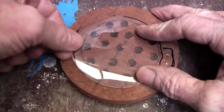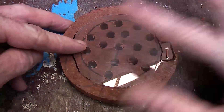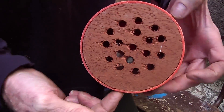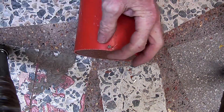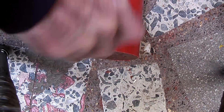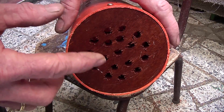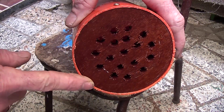So now that will flap up and down. When water shuts it from below, when you suck it opens and lets the water through, then it shuts again with the weight of the water. I am going to put the valve — the plastic side — into the pipe, then make a hole and nail or screw it in solid. Put several fasteners to make sure it won't fall out. If the edges are not sealed you can add a bit of silicone, but once it gets wet after a while it will swell and those gaps will seal and it won't leak as much.